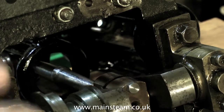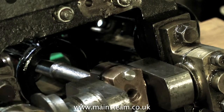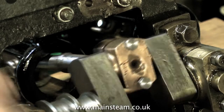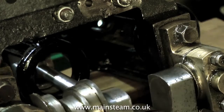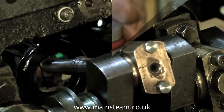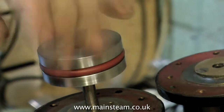Temporarily I'm using a couple of 2BA bolts to hold the bottom bearing in place. What I do notice is there is a large gap between the bottom bearing and the top bearing. That's because some fool in the past has removed far too much metal from the top bearing. I have a couple of options open here which I will be discussing in detail in the next video.